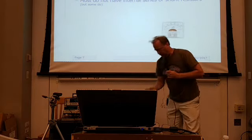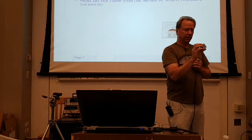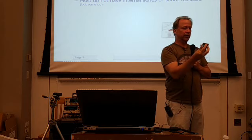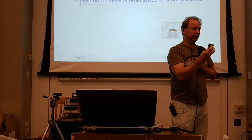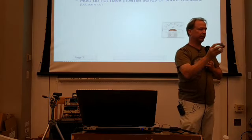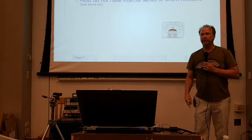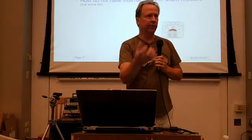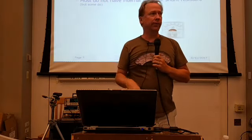I've actually got an example here I'll pass around. This one, if you look carefully through the clear black plastic, you'll see a pair of resistors in there. And there's actually 3 terminals on the back of this one. This is calibrated as a voltmeter with the resistors already in there. I'll pass this one around. If you look really carefully underneath the tiny piece of circuit board, you'll see a couple of resistors in there. But that's a bit more the exception rather than the norm. But you can take a look and see what that looks like as well. Again, most of them are not going to have them in there. Even if the meter says it's 100 volts full scale, it probably doesn't have the resistor in it.